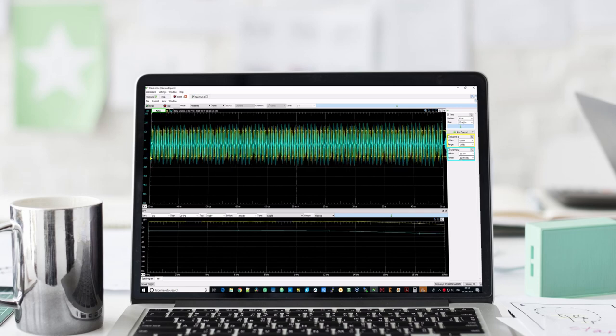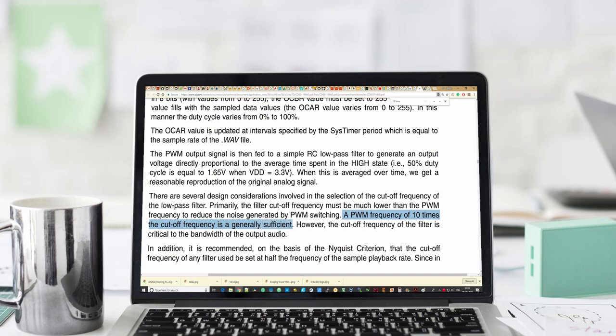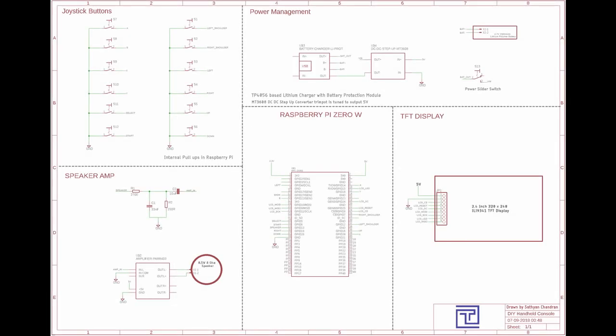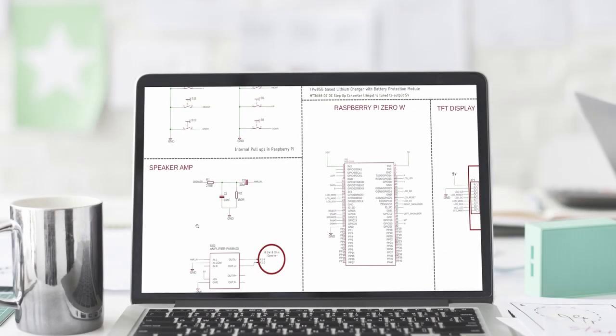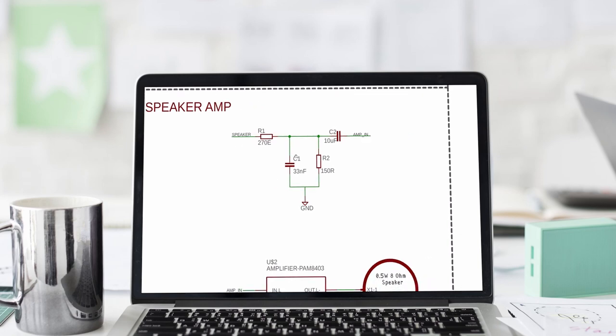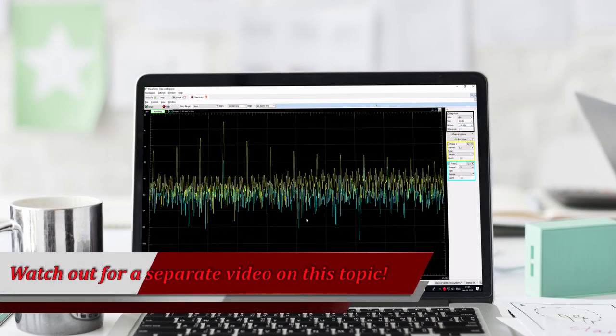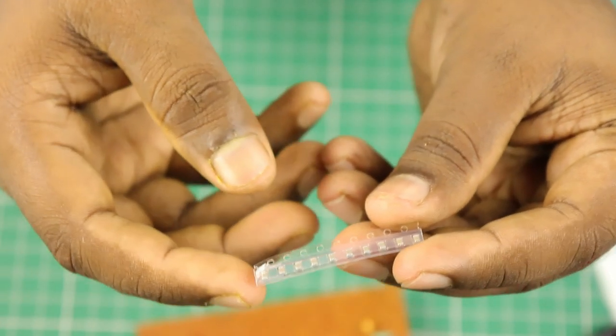We are using this PWM signal to fake as the audio. Humans can hear frequencies ranging from 20 Hz to 20 kHz, but to listen to audio from a PWM signal, the PWM frequency should be 10 times that of the audio signal frequency. Our Pi can generate up to 50 MHz pulse width modulation signal, which is more than enough for proper filtering. The resistors R1 and R2 act as a voltage divider to reduce the 3.3V to 1.1V to limit to the safe line voltage. R1 and C1 also serve as a low pass filter with a cutoff frequency of about 18 kHz, which filters out the high frequency signals. The C2 capacitor filters out the DC component. Let's assemble this filter and place it in between the Pi and the amplifier.